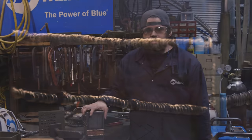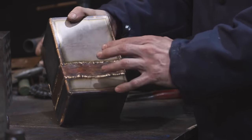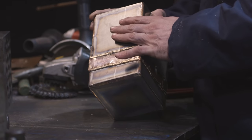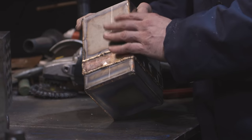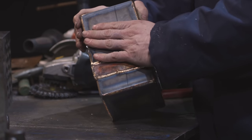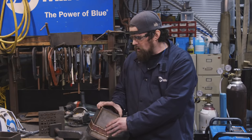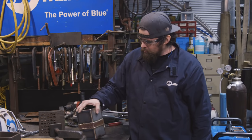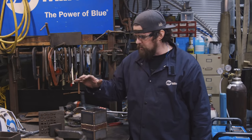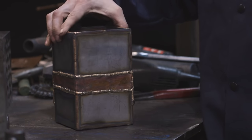We got the base completed. I got the copper strips brazed on with silicon bronze rod to the mild steel and to the stainless steel. There's not a lot of contrast in color right now, but there will be — the mild steel untreated will patina, change color, and change texture. You can even treat it with some things to make it pop so you'll get that contrast. The copper is going to weather and that'll look super cool, especially as you use water, dirt, or whatever in it. It's going to take on a life of its own — it's kind of a living, breathing thing. I added a little TIG bead around the tip just to give it a different look.